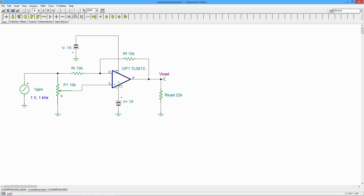Pretty spiffy little circuit — one op-amp, a couple of resistors, and a potentiometer. How does this work? The first thing I want to point out is that you have two inputs, basically. You can think of this as having an inverting path and a non-inverting path, where this is controlled by a potentiometer, which is basically setting up a voltage divider. I can't control the pot in real time here, but I am going to change to different values so we can see what's going on.